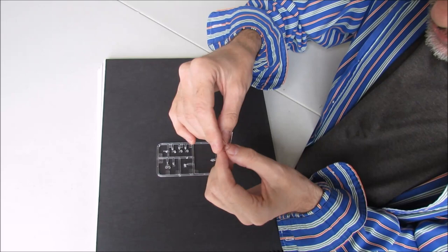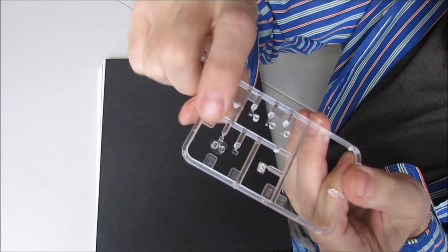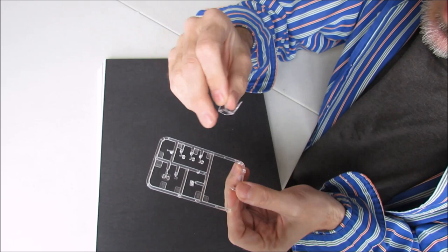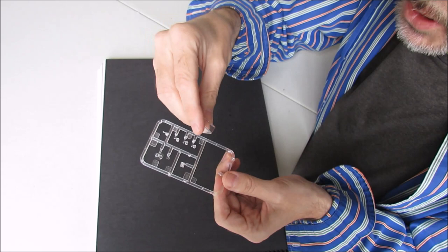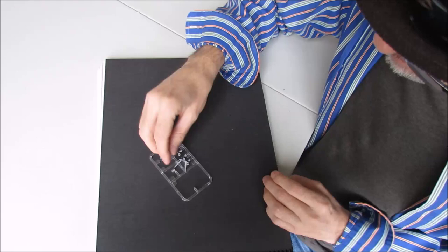And I'm guessing that that wasn't packed out very well. And the reason being, they're trying to get a fine balance. We've got all the small lens parts on here, and as you can see, there's a lot of flash around those lens features. And so what they've done is a balancing act. If you put more pressure in the sprue to pack this out to get rid of that distortion, you're going to get a lot of flash around these smaller parts. They could have done a little bit more with the tool to overcome that. I could describe what they could have done, but I'm not going to go into detail. This is just an inbox review, not a technical education program. But anyway, let's take a couple of shots for you guys of that sprue, and that'll be it.